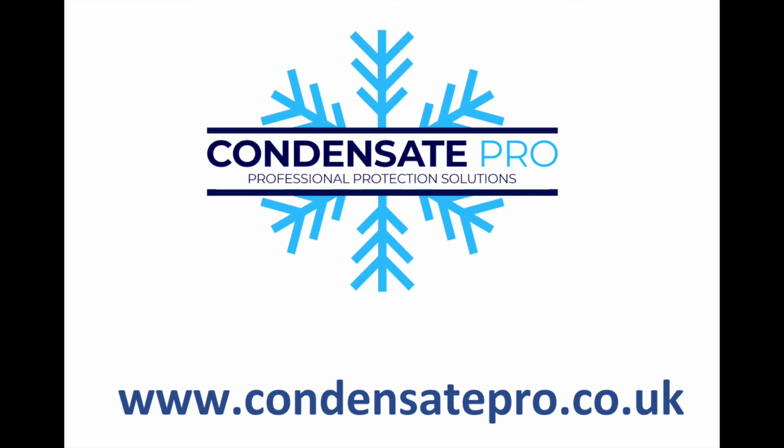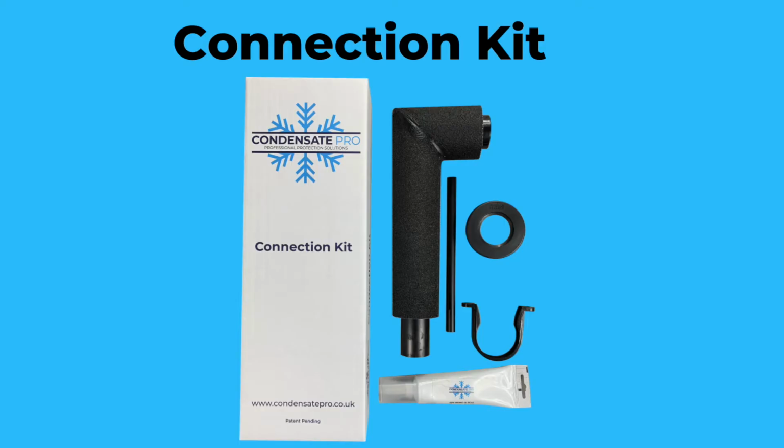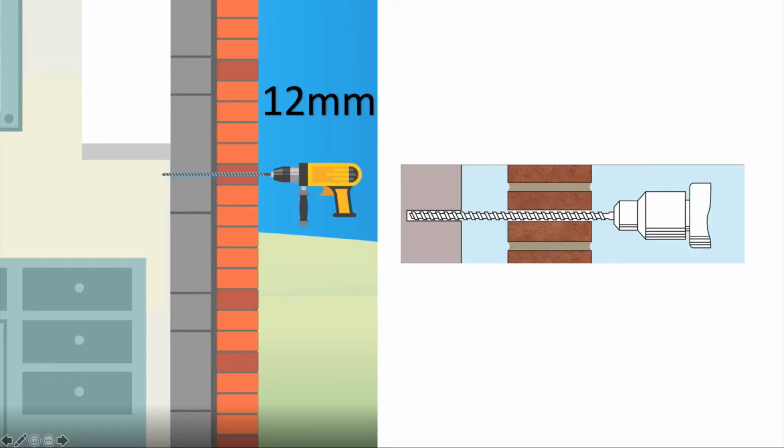This video takes you through how easy it is to connect the Condensate Pro connection. The box contains one ready-made connection, one 50mm pipe clip, one spacer bar, one pipe snug, one tube of bond and seal. On a new installation, drill a 12mm hole.